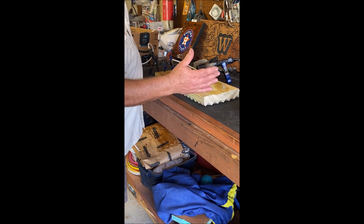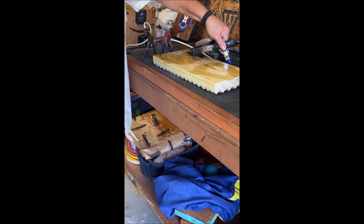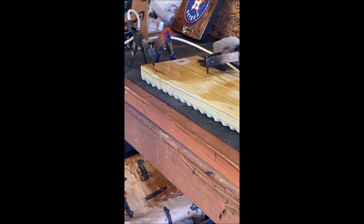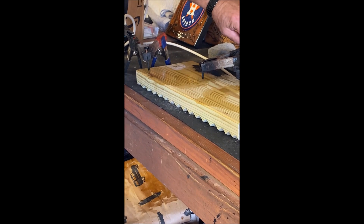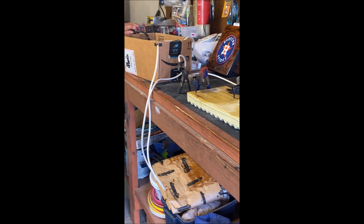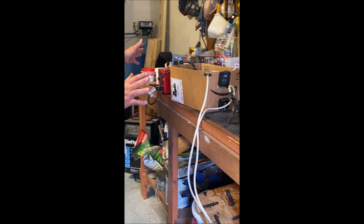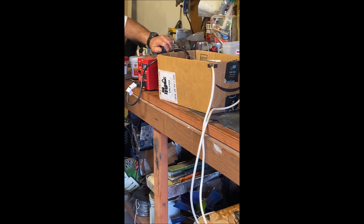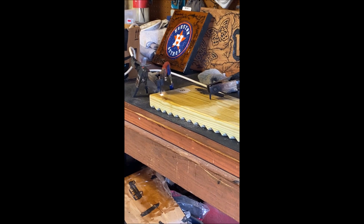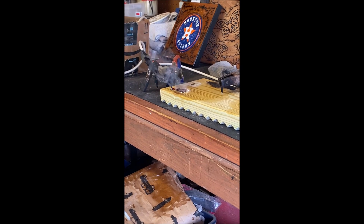Here I put the solution on half the board in the shape of a heart, but now the water has seeped into this very porous pine, so we'll at least see it only burn around this circle. We're going to let it randomly burn wherever the electricity wants to go. I can sometimes control it with the variac — turning power off and back on — and it might go in a different direction. Even as you can see, I'm only touching the probe in safe areas, even though I know the variac is on zero and my switch is off. I still don't want to die.